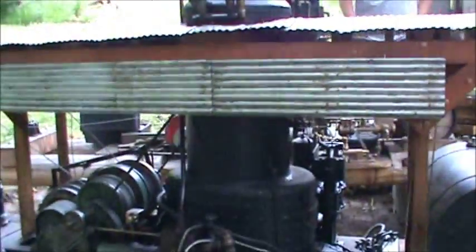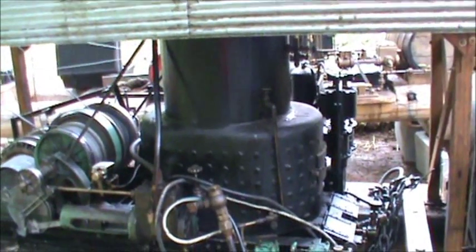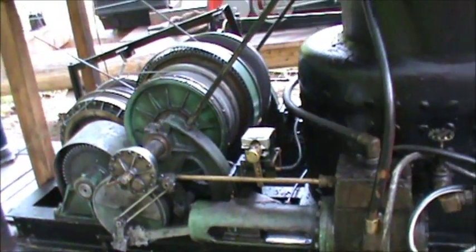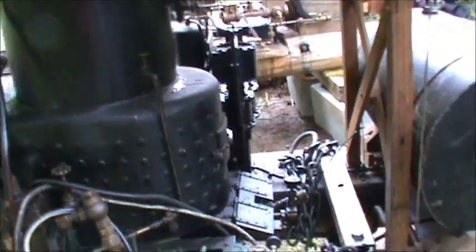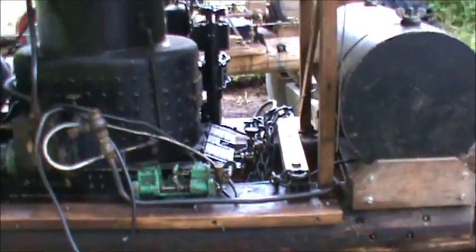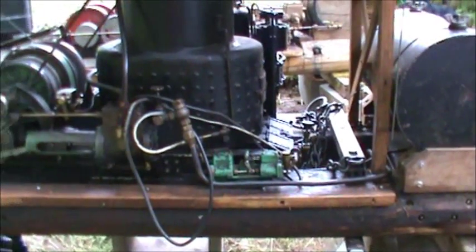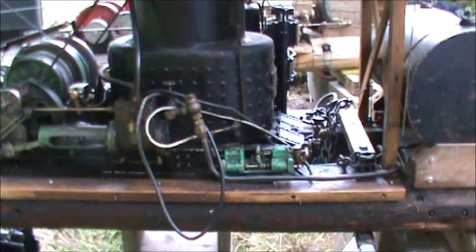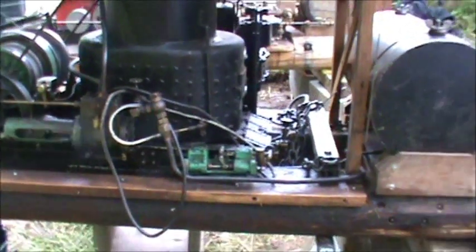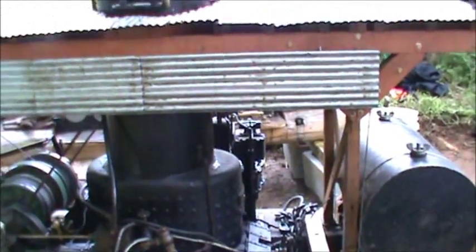Here again, look at this boiler, how this firebox is in this boiler. Last minute things, you can see how it's wider at the base. That's the way this machine was built. Look at the castings in this thing. Beautiful. I mean, it's dirty, but it's been used, but it's beautiful. When I was running that cat, there's a water tank here. A little steam pump. That's a miniature of that steam pump, and I have a steam pump like that on one of my other machines. So this is how it originally was, bigger at the bottom? Well, some styles were that way. That was just a certain Willamette style of firebox. The whole thing is a firebox, so you can put really large wood in it, keep your steam up, or a lot of coal.